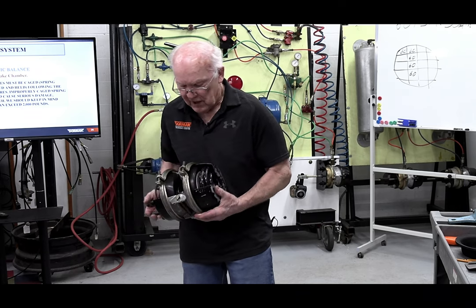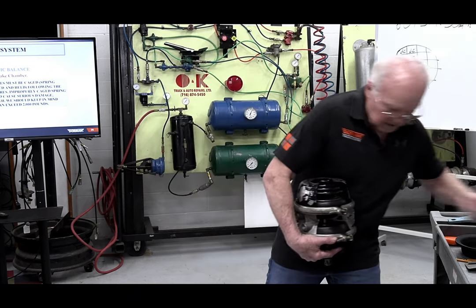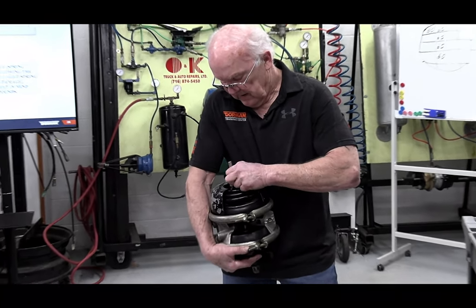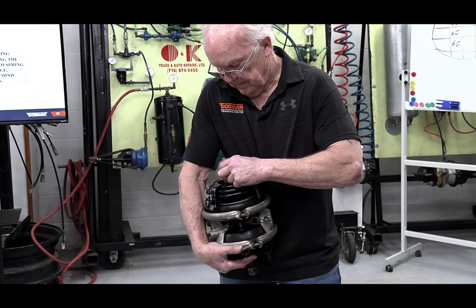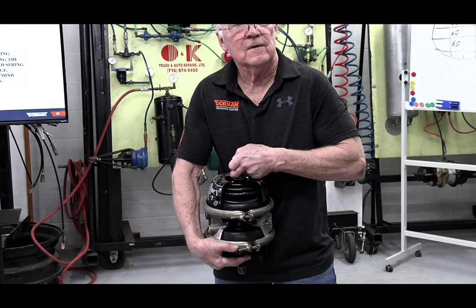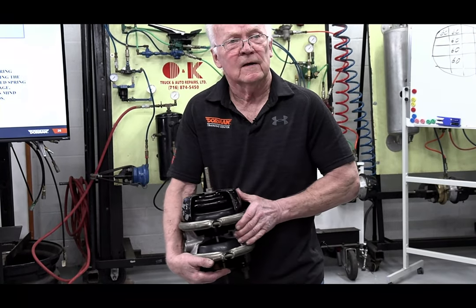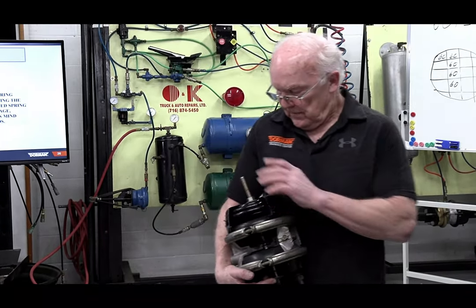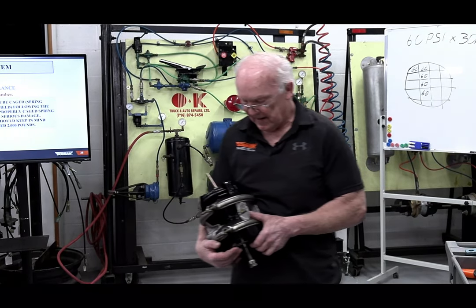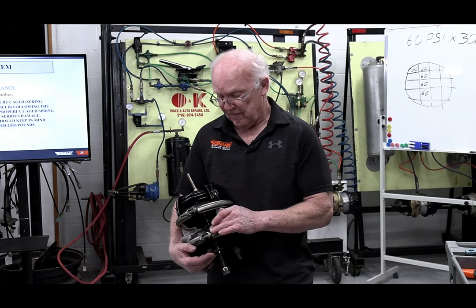So basically what you're trying to do, if you have to service this portion over here, you put a caging bolt in here like this. You turn it, lock it in, and you put this nut right back in over here, and you just start squeezing. By the way, if you're on the road or in a shop, you can purchase very deep sockets. Why keep wrenching it over there? They work out handy. Now you're safe to, at a minimum, replace this service diaphragm.